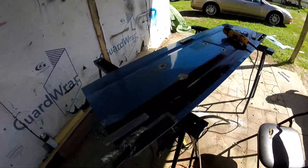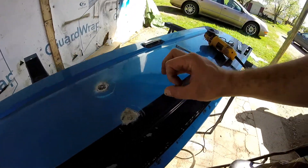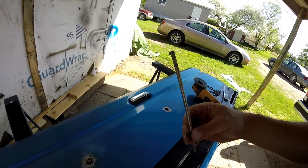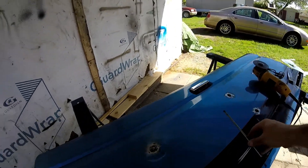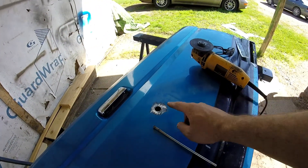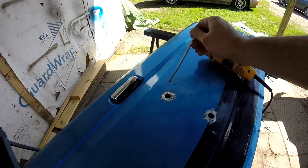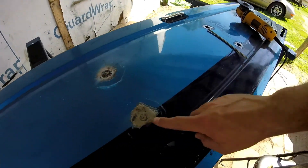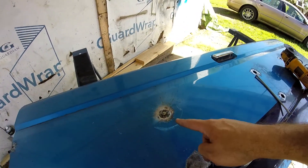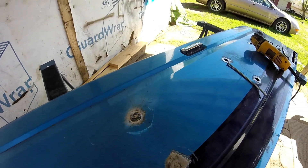I got a little ahead of the video, but all I'm doing is taking a little circle disc of metal, welding a rod onto them, and then making them the size you need to fit in the holes with the grinder. Then we just hold them there and tack weld them in. This one is all polished so that one looks nice, and this one I just welded in - so that's what it will look like before you grind it.